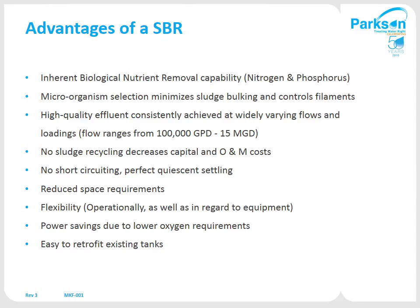You have a lot of flexibility to change the set points so that you can do longer air times and longer settle times — it's really what the operator wants to adjust these variables to. And there is no specific tank geometry requirement; you can basically do round, square, or rectangular, any type of tank geometry.